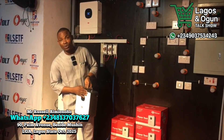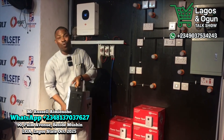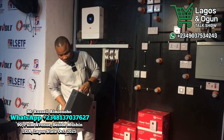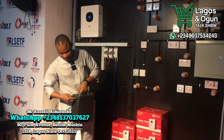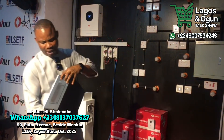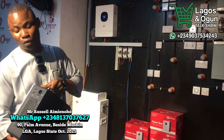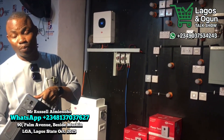It has 500 watts of solar input inside and a one kilowatt lithium battery inside. To charge it, you can plug it in. It takes greater than two hours to fully charge the battery. And if you want to use a solar panel, you plug in here — the PV input goes from 12 volts to 60 volts. For those who understand, that means you can carry one big solar panel of 550 watts.